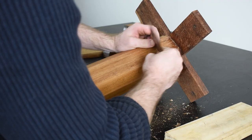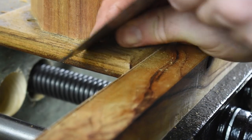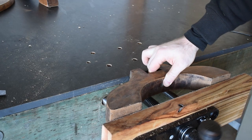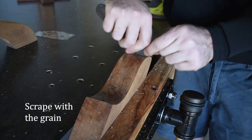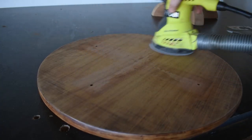It takes a little bit more elbow grease, but using a scraper early on can remove a lot of the material, meaning that there's less sanding to do later. It looks and feels smooth, but you can see that there is varnish and stain stuck in all these lower sections and pores.